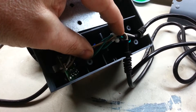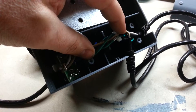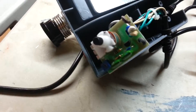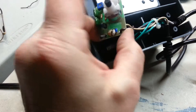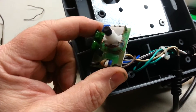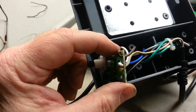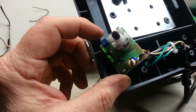That's not a good sign. Although there are some irons that use the change in resistance of the heating element itself to monitor the temperature, I'm kind of doubting that this is one of those, seeing how small this little board is. In fact, I pop it out and there is one and only one active component on the whole board. So I very strongly suspect this is merely the equivalent of a light dimmer — just a very small triac using phase control. This is really not a temperature controlled iron but a power controlled iron, which is not the same thing at all.